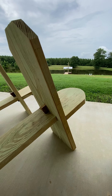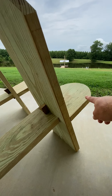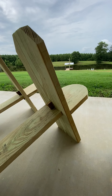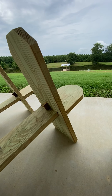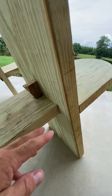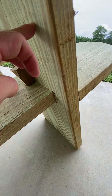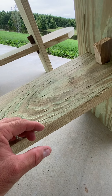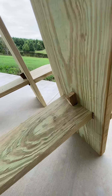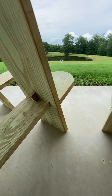The seat, all the way back to the bracing that holds it up in that position, is 40 inches on that particular piece. You can see here where we had to make a slot that this piece slides through. On the upright, we took two inches off — two inches on this side and two inches on the other side — and slid it through. That's what we had to remove.